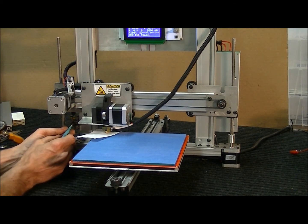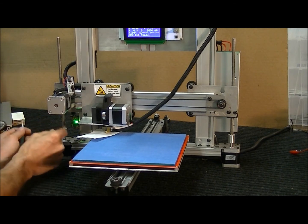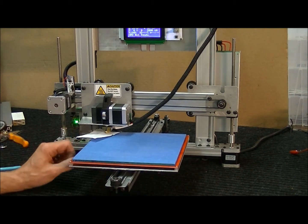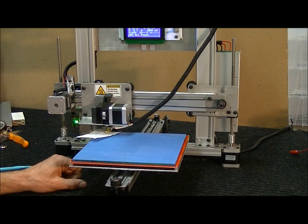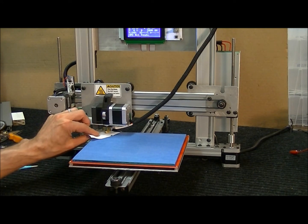I'm going to turn the potentiometer clockwise until that LED comes on, then back off just a hair and turn it back clockwise. You want to find the very edge point where the LED just turns on. Now I'll hit the Z home button to check — and I've got the proper tension. You should be able to grab the paper and move it back and forth with some resistance. If you can't move it at all, you're too close to the bed.